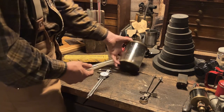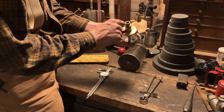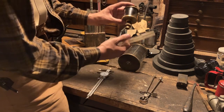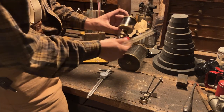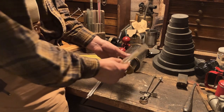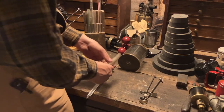In this case, this is just a standard drip oiler so it doesn't need a tight seal, whereas an engine cylinder oiler like this one needs a tight seal. If you look inside this little system here, there's a check ball. So if there's a bit of blow-by from the engine cylinder, it won't spit the oil out the top — that check ball will lock it. Sometimes you see these oilers with small pipes to the side, and that's for the blow-by pressure to go through the oil and out the top instead of splashing everywhere. That's a way to tell a cylinder oiler from a standard drip oiler.